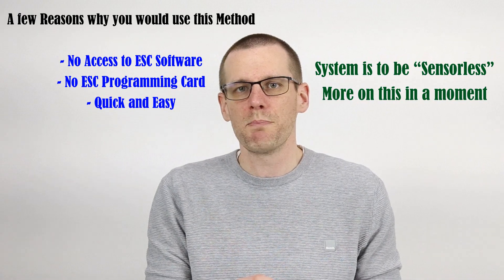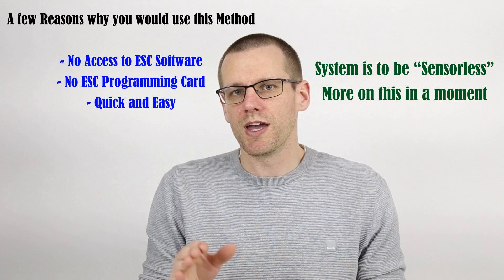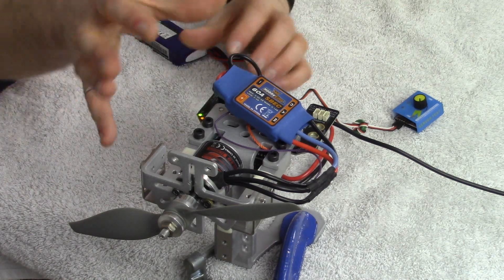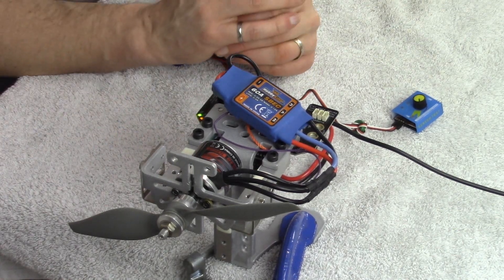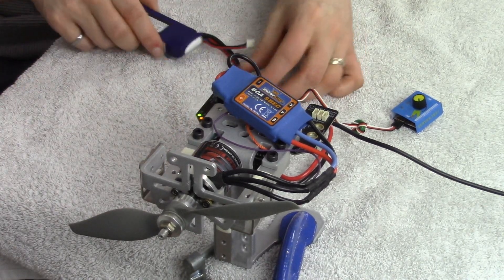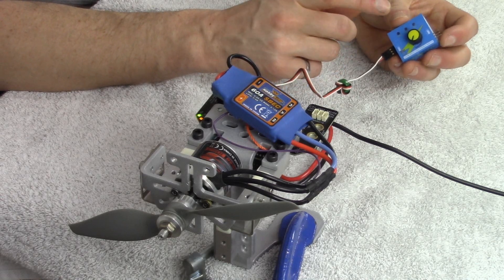We'll talk a little bit more about what happens if your motor is not a sensorless motor. Let's start by showing you a quick demonstration of what happens when we swap the leads of the motor. Here is the dyno we're going to use to show the direction of the motor. I'm going to have this brushless motor connected to this speed control, powered by a two-cell lithium polymer battery pack. This is a very low-powered setup — you're probably going to see around 100 watts or less. I'm going to control the speed with this servo tester, and from there we'll be able to see the direction of the motor based on the thrust we're getting from our propeller.